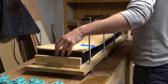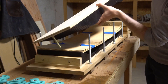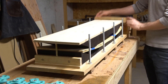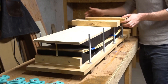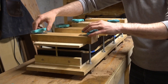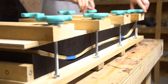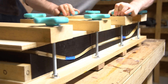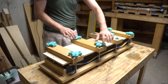This is a DIY spar-style press that I showed how to make in the last video. It's a simple, inexpensive build and it delivers a surprising amount of force. All you have to do is lower the top of the mold in place, drop the spars, and clamp it down. These are just some 3D printed knobs with captive nuts that fit the bolts on the threads — they save me from having to use a wrench, which is slower. Once the press is clamped down as tight as you can get it, leave the deck to cure for a day or two, then unclamp the press.